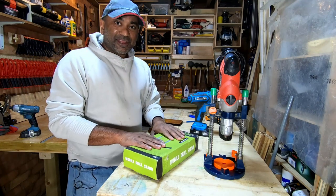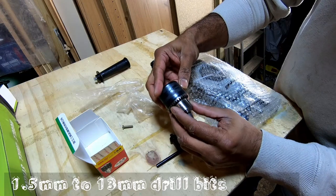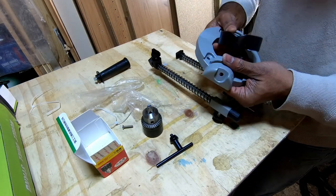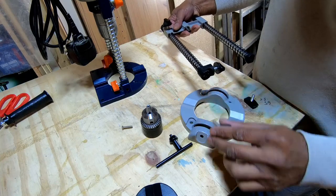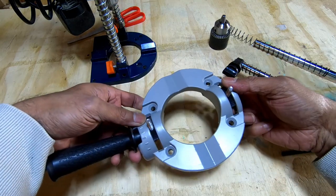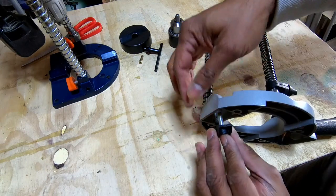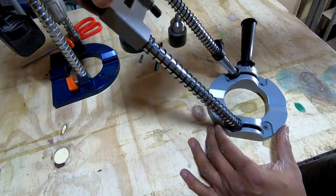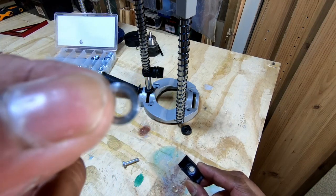Let's unbox this and see how it looks. The chucks that come with it take bits from 1.5mm to 13mm, which normally covers all your usual woodworking drills. The base is flat, a metal alloy — I'm assuming aluminium alloy, slightly hardened. It's not cast iron because I checked with a magnet and there were no magnetic properties. The plastic bushings on either side take metal bolts which get screwed onto the handle. When I first tightened it I found a bit of play, so I used a couple of washers to give it more meat so that when you bolt it in it gets really pulled tight.